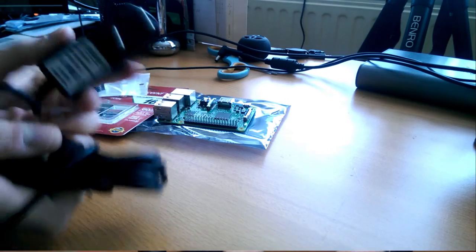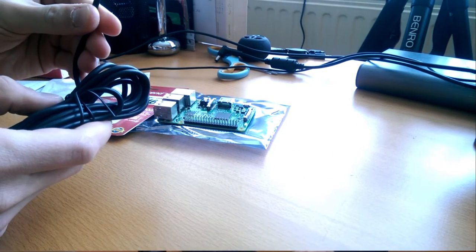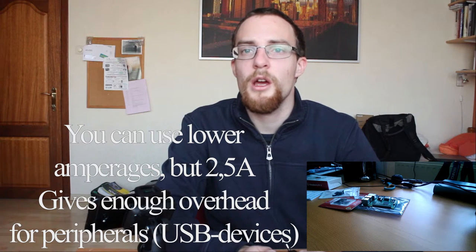And finally we'll need a power supply. I bought these since they have a longer cable — you just put this in the wall. This is the micro USB connection that you mostly know from smartphones. It is a 5 volt charger and 2.5 amperes. As a community project you could ask visitors of your library to donate their older phone chargers so you can use them. Before you connect a Raspberry Pi to a donated smartphone charger, be sure to check whether it still works properly and if it actually puts out 5 volts and 2.5 amperes — anything less may cause you to run into problems.